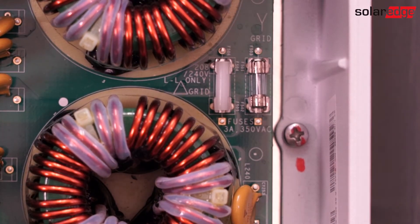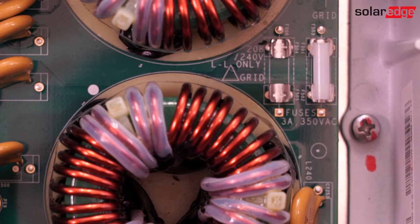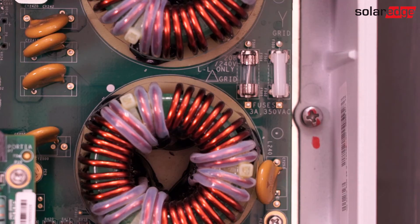In order to reconfigure the inverter to 3-wire delta grid, swap the fuse and the dummy fuse, so that the real fuse is in the delta grid position. Be sure to swap fuses in both the primary and secondary units.